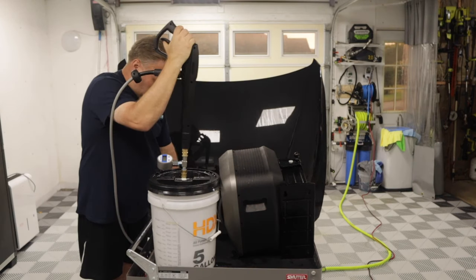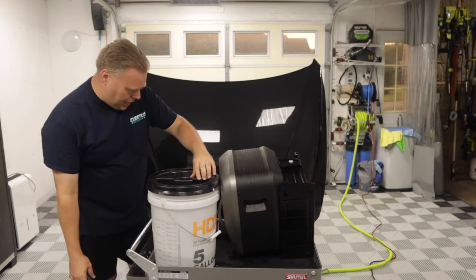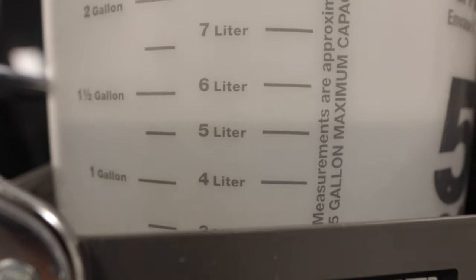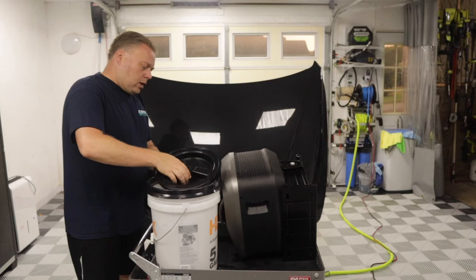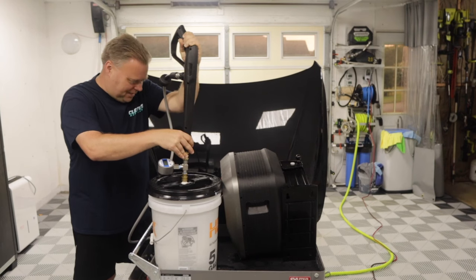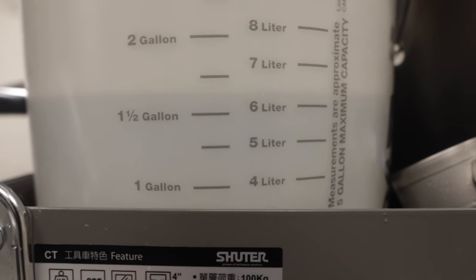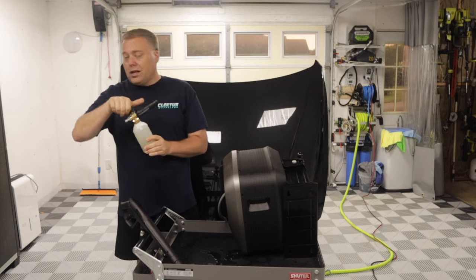Now the bucket test. This is the stock 1.9 orifice — I'll run it for one minute. It was shaking the whole cart, water swishing back and forth. Pouring that in to settle — stock we're already over 1.25, I'd say about 1.3 gallons per minute. That's pretty good stock. Now let's do the 3.0 tip — just a little bit of leakage on top, but definitely way more than stock. Dead between 1.5 and 1.75, so about 1.62 gallons per minute. Really good numbers.